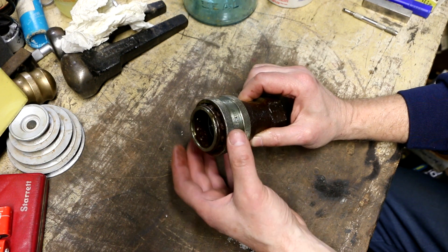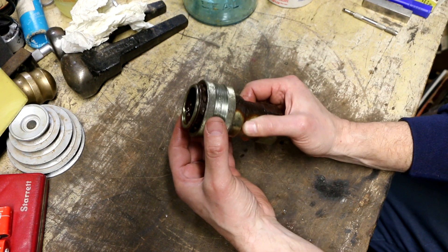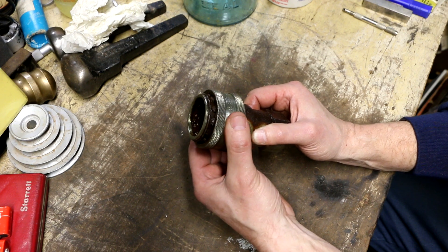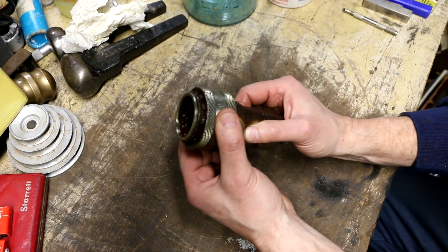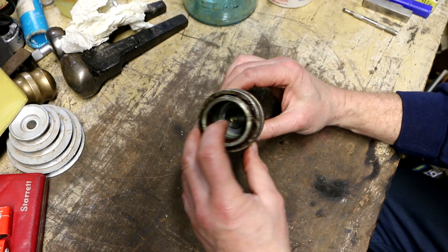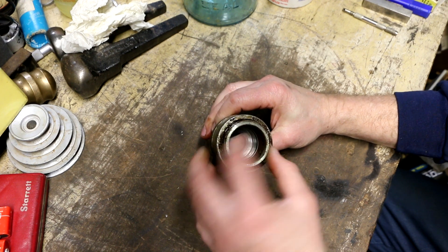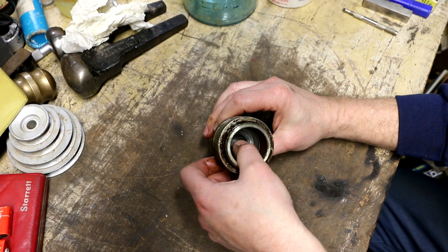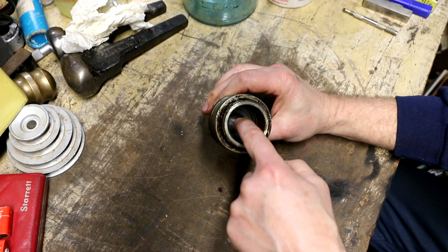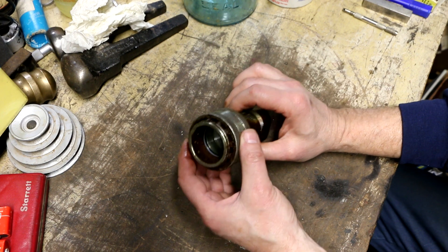When it's working properly, this ring right here should be able to freely rotate around. There's a spring inside, and the idea is you pull back on this ring. After you pull back far enough, you can pull the coupling and it will disengage from the nipple that goes inside. Then automatically, as soon as it disengages, this little check valve right here — which is held closed by a big spring — snaps shut and shuts off the flow of hydraulic fluid, so you don't lose a lot of hydraulic fluid when you disconnect.